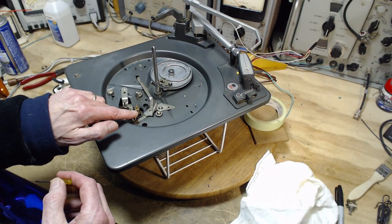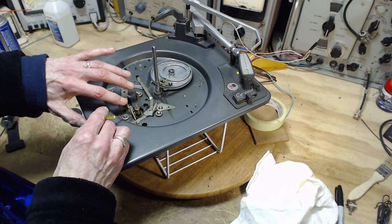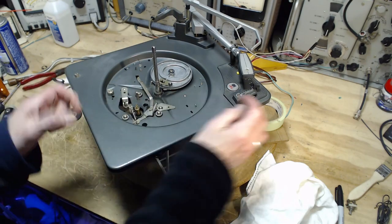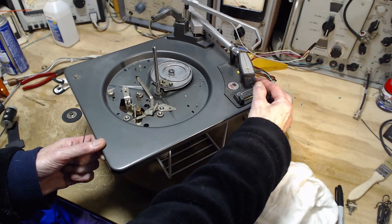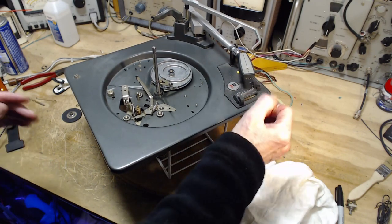This gives you some idea of the kind of tension that's here. Now, normally there's the intermediate wheel on here, and that pushes this a little bit. And this spring is barely opening. It's very weak. If you put a really strong spring in here, I think you end up feeling it over here and feeling it here. So what are nice light operations become tougher.